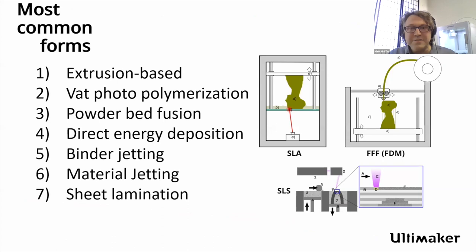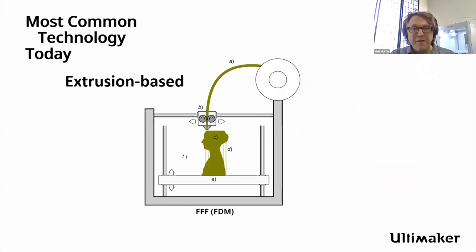There are a number of technologies for 3D printing and additive manufacturing, and in truth there are design considerations, constraints and opportunities, and material and processing needs for all of them. We're going to talk about this in terms of FFF and FDM. FDM — Fused Deposition Modeling — is the trademark term; FFF is the generic term. FFM is another option out there with emphasis on manufacturing. It involves extruding material and building your object up from the ground, but there are some unique considerations.